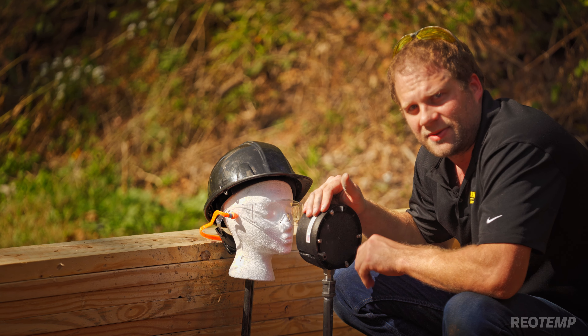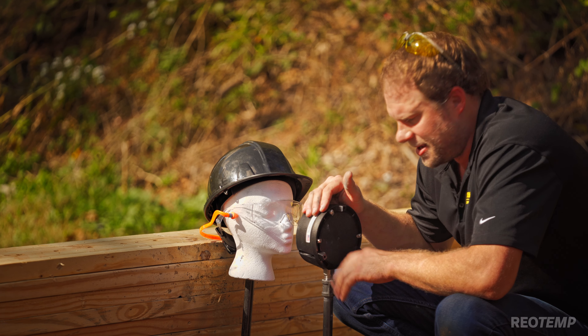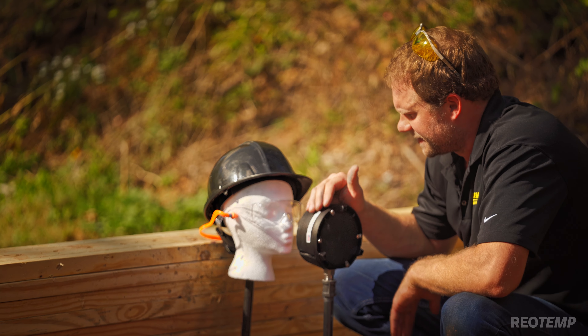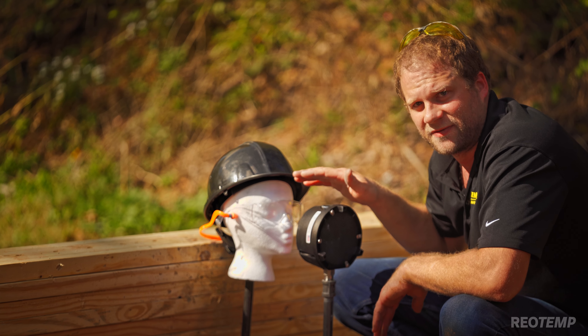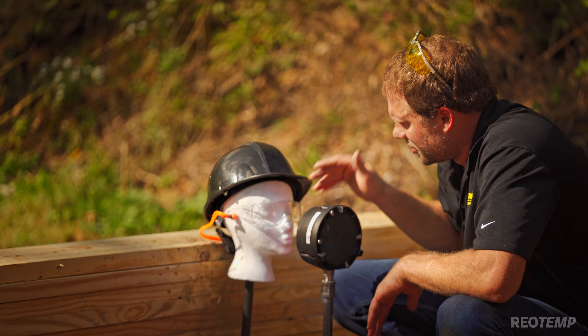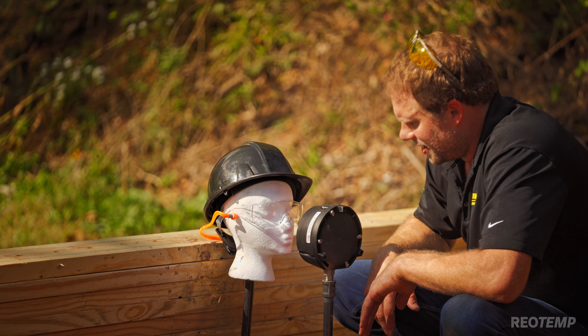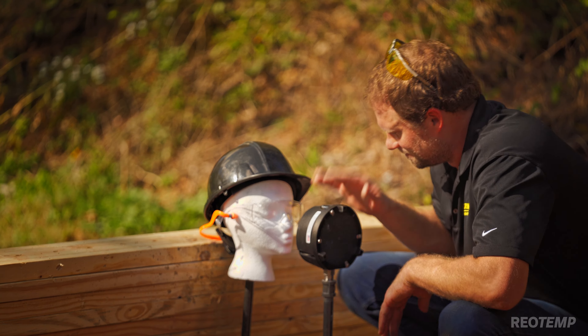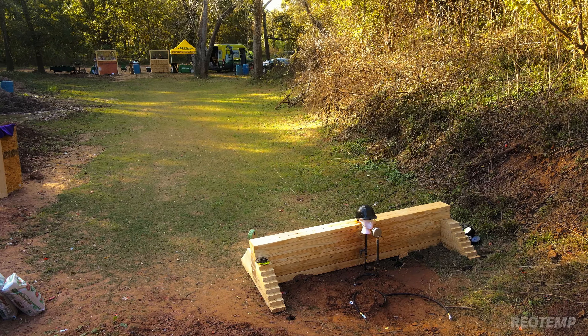The Bourdon tube is a thin wall — it's only 0 to 30 — so the wall thickness should be thin enough that with a very low pressure spike inside the tube we'll get it to rupture. The blowout plate is designed so that it blows backwards and none of the force of the explosion will go forward toward our technician. We're going to light it up and see what happens. Fire in the hole!